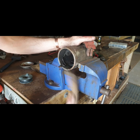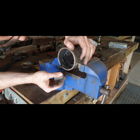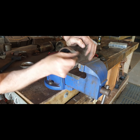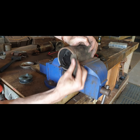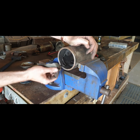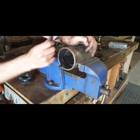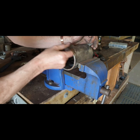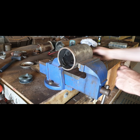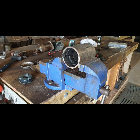That's where the backing plate goes in there. All of this just helps the final result. Nice quiet dynamo, putting out full whack. Right, that's good enough. Don't see any burrs there at all, really, worth speaking about. So that's that, that's ready for primer. Once I give it a blowout of the air gun, I'm going to get him primed.